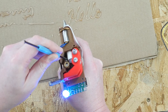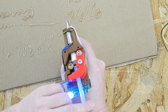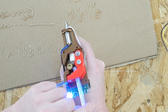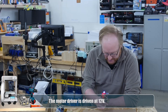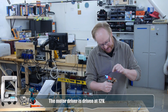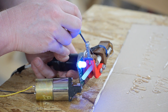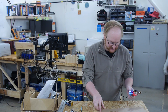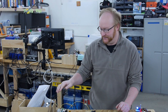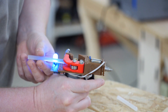We should have just had something right here blocking that. The next stick comes in — but see, that's also a problem because see how it retracts? It does that to prevent oozing, which is cool, but it also makes it kind of hard to load the next glue stick. This also has a 5mm shaft and a standard 3D printer gear, and if you look at it compared to the other gears we tried, there's notches in it for the filament. This gives us additional surface area to pinch it — you don't just have the teeth, you have both edges of what was cut out.